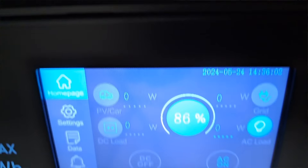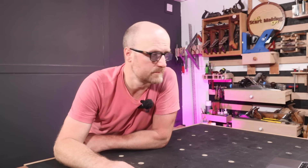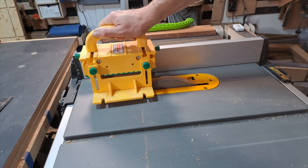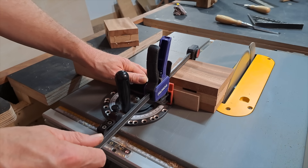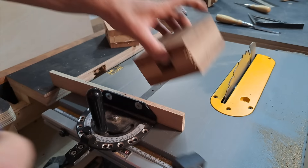For the second batch I made the mallets exactly the same and, to save messing it up on the table saw, I cut the wedges again with the jigsaw. Now normally I would clean up the heads of these mallets by hand, just use the plane for all of it. But I decided to go outside my comfort zone and plane one side to get it flat so I could run it along the fence and use the table saw to do the other side. I raised the blade to the height of the mallet head and had a sketchy moment — the alarm went off. I halved the blade and ran it through twice, flipping it in between, which did the same job with far less blade showing. Clamping the head to my mitre gauge at the five degree angle to clean up the faces worked really well and felt a lot safer.